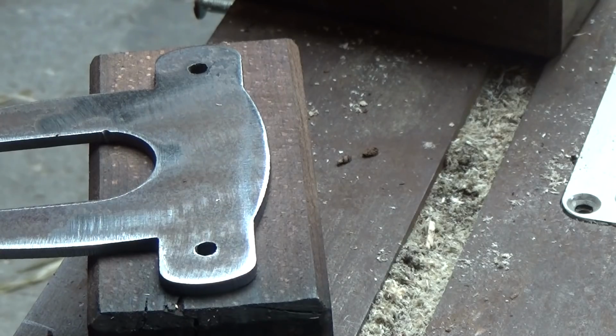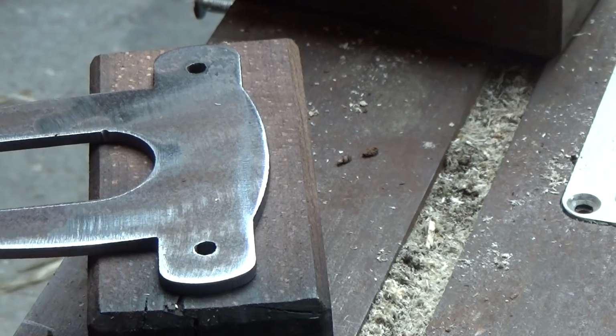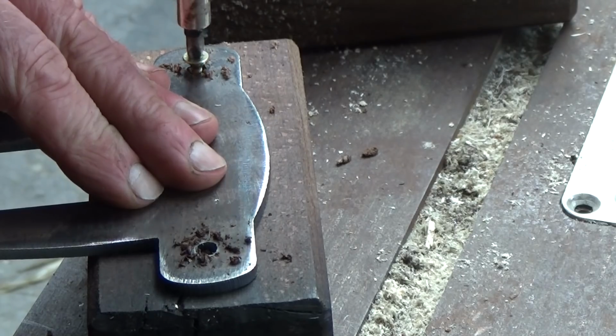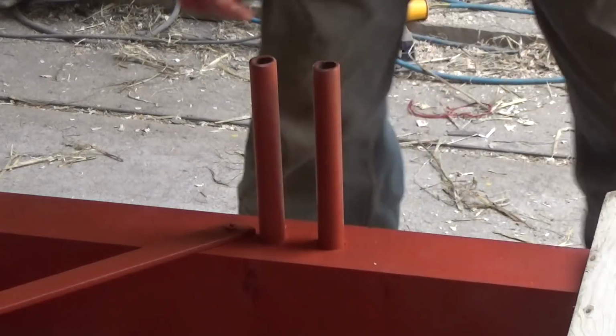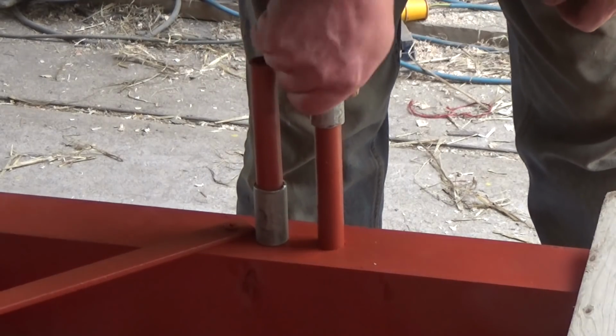This design isn't traditional, I think, but it might work anyway. The vertical pipes hold the block in place and also provide the forward-backward stops for the axle at the same time. I know there are plenty of other ways to do this, but I thought this would be simple and very strong.